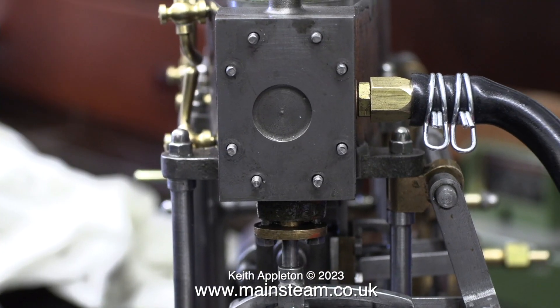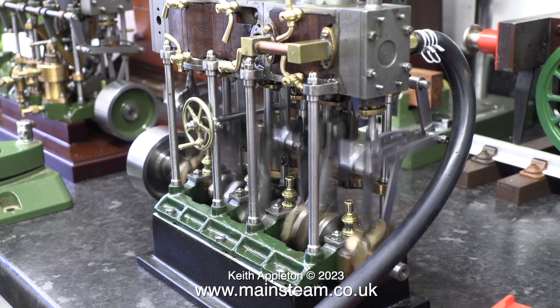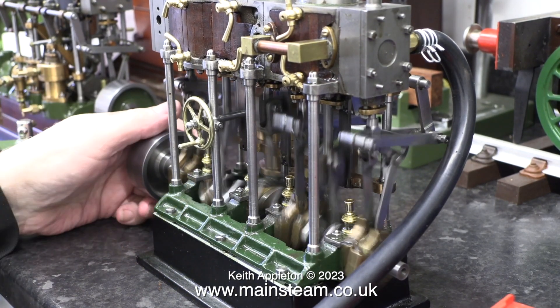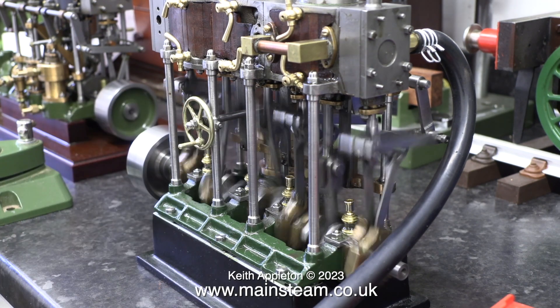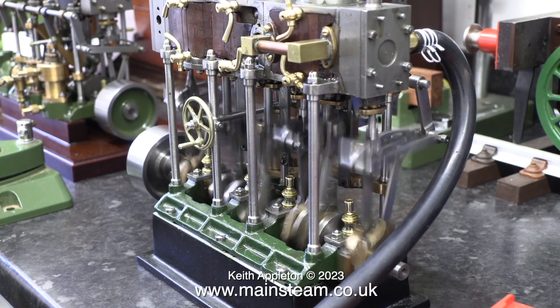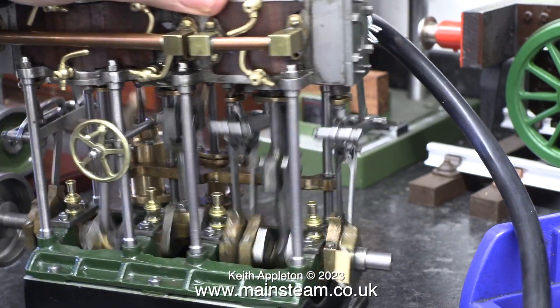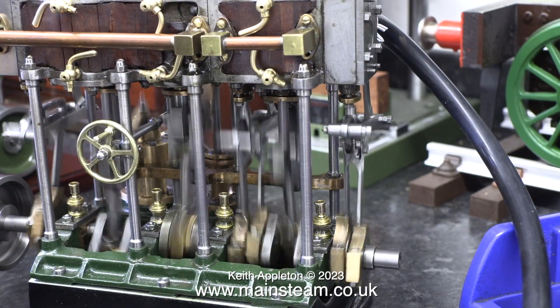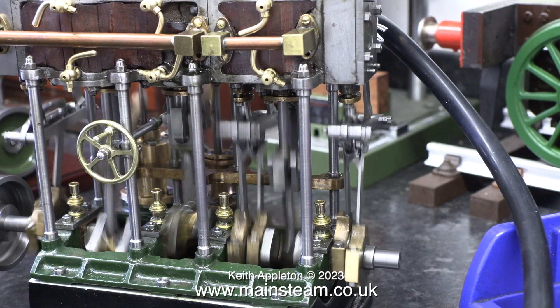This clip clearly shows how the silicone rubber tubing is connected to the engine — I made a fitting in a previous episode. But look at the piece of tubing now. Here I'm running at about 60 psi and it's starting to balloon out, and it got a whole lot worse than that and even burst a couple of times. That's why I went to a place called Wold Engineering and bought a proper airline. I'm going to make a fitting and an adapter for it very shortly.